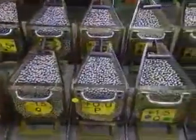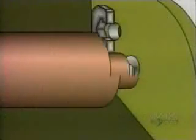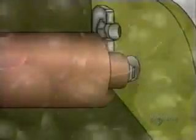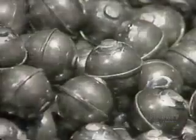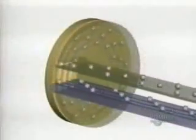Elsewhere in the plant, they classify the steel balls according to size. These balls started out as steel wire. A machine cut them into pieces and a die punched them into rough balls. Those rough balls go into a grinder, which removes the bumps. Then other machines round them out and give them a mirror finish. This entire process takes a few days. The balls go through a furnace to harden.